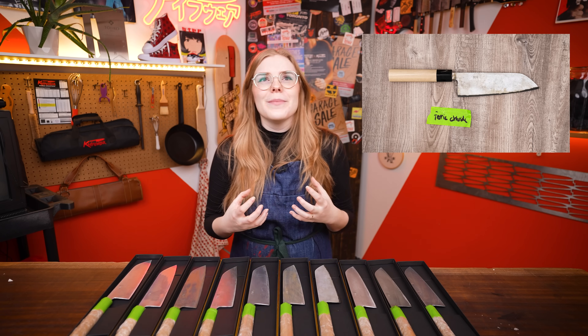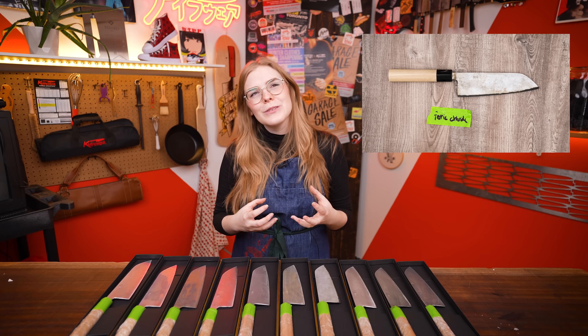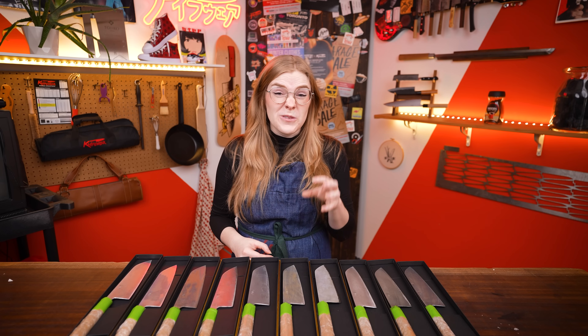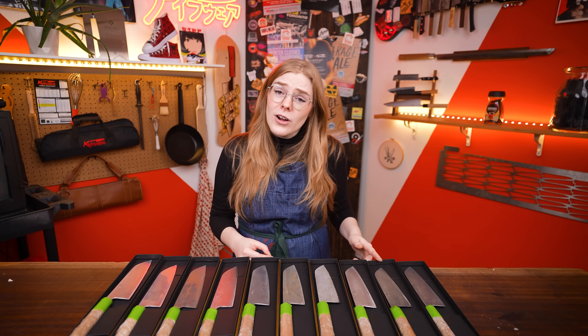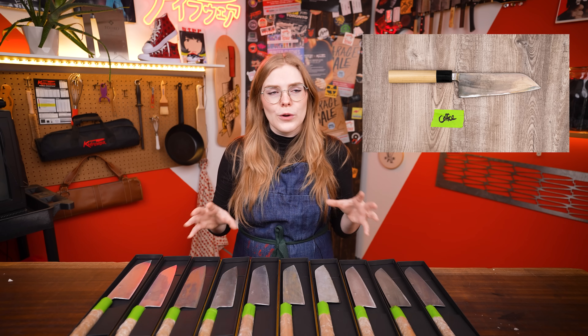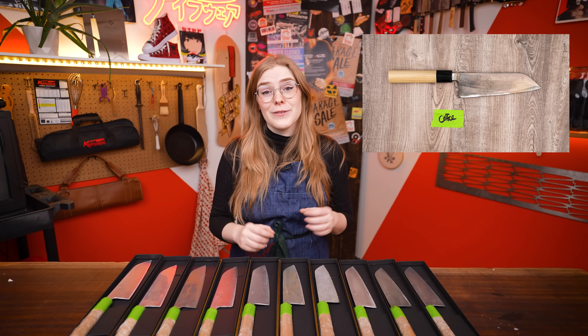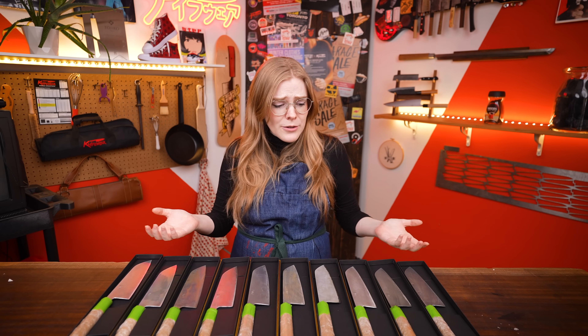I think I have three winners for this video. First is the steak method — it makes a really pretty color and it's not so deep in science experiment territory that it'll mess up your dinner. You can throw it in as you're prepping things and it builds a really natural-looking patina. I also really like the ferric chloride — the acid etching look makes a patina that doesn't just look used, it looks old, like it has history. The core steel gets really dark too. And coffee — tried and true, great even overall look, and plays well with Kurochi finish. Let us know your favorite in the comments. If you're interested in buying any of these pre-patina knives, they'll be available at the spring garage sale, May 13th to the 20th. Hope to see you there.